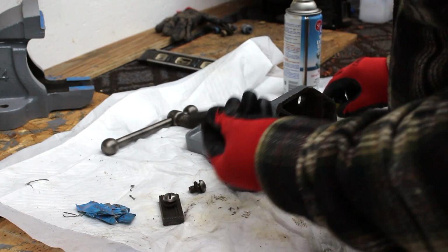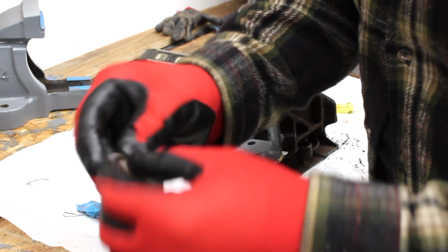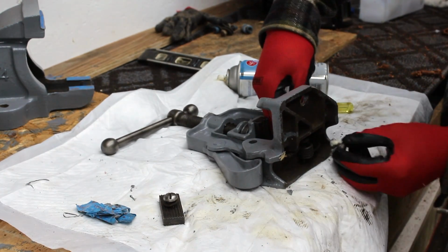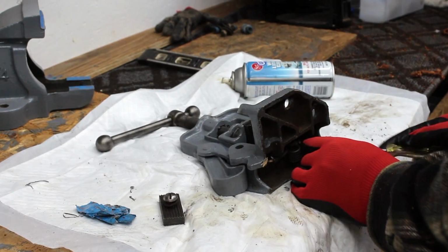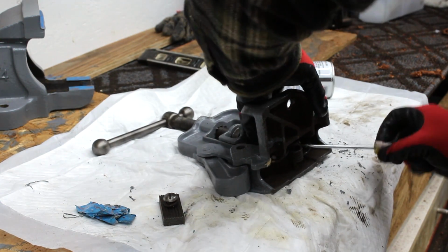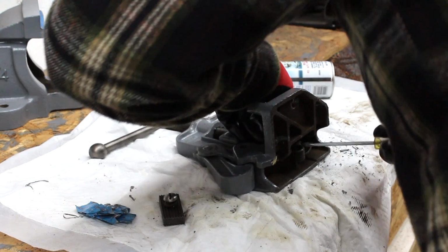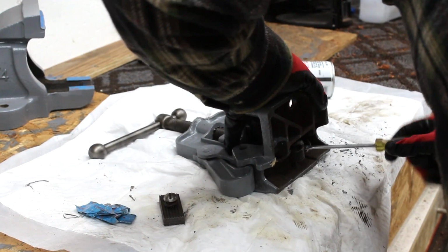Okay, so here we go. So, got the screws. These screws that come out of this thing are massive. You can see there, must be a good 5/8-inch diameter head. I assume they wanted to be put together with a lot of torque, but anyway, so put a little lithium grease on here and assemble these from the bottom. Put it through here, a little easier to work with. Well, that side doesn't want to go very well, so I'm going to flip this over. Maybe the threads are clean on that side. Let me try it this way.